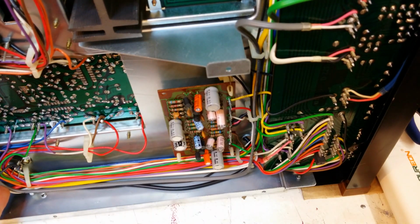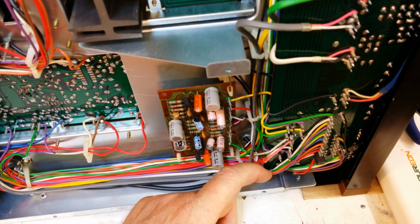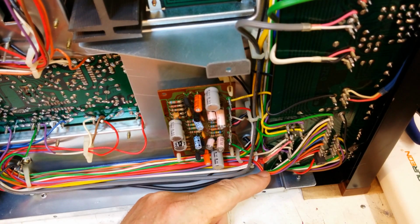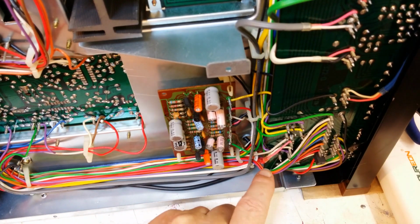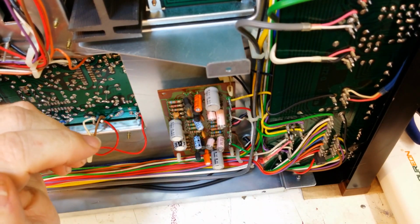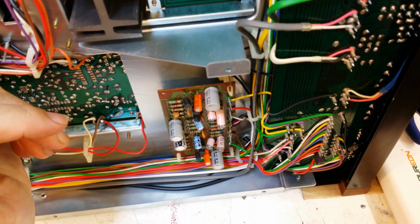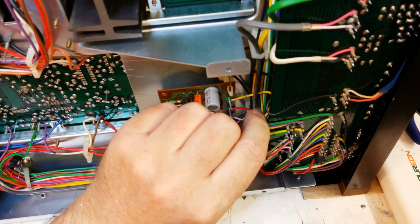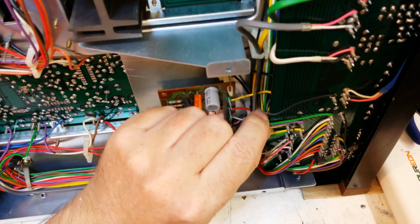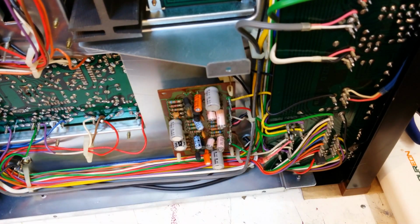Right, okay, so I might do better to put it here, and then I can find some voltage. There must be a supply rail voltage on here somewhere. Let's have a tap round with the meter. So we'll get it powered up now, it's safe, and we'll have a tap round and see if we can find a reasonable voltage to feed a 7805 with.